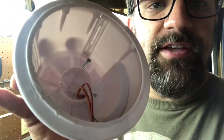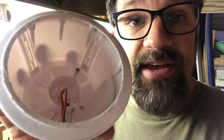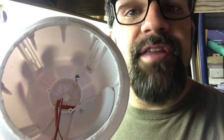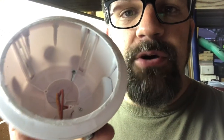That might be easier. All right, so I found some screws that will fit in there. They're M3s, and they're a little bit large, but that's okay because I've got a tap. So I've got an M3 tap inside. I haven't actually tapped these out yet, but there's enough there that they can grab into the plastic. And with a tap, hopefully it won't break the plastic and split it apart if I screw it in too hard. So I've got the right screws there.